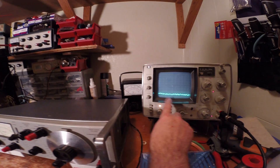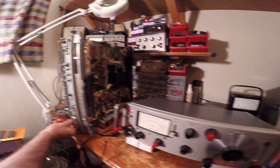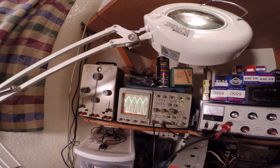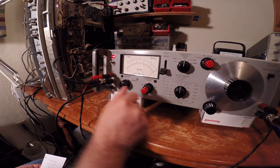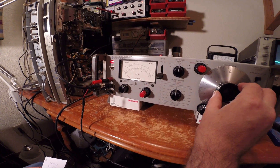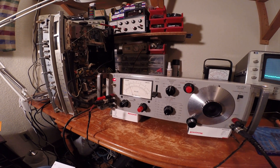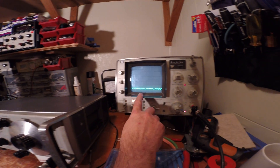You can also see over on the spectrum analyzer that there are no harmonics showing up. Now we're going to take the voltage up another 5 volts peak, which will take the power up to 14 watts, and we're going to make another distortion measurement. The distortion has even dropped a little bit at that power setting, and that makes sense because as we look at the spectrum analyzer over here, we see no harmonics.